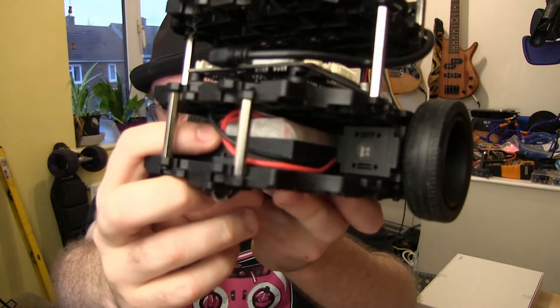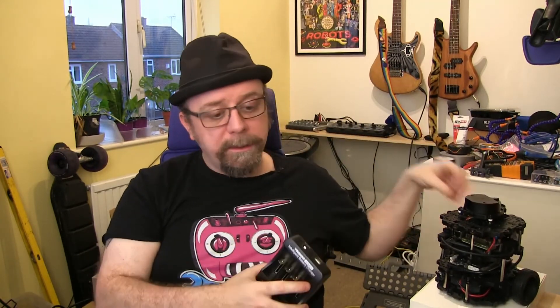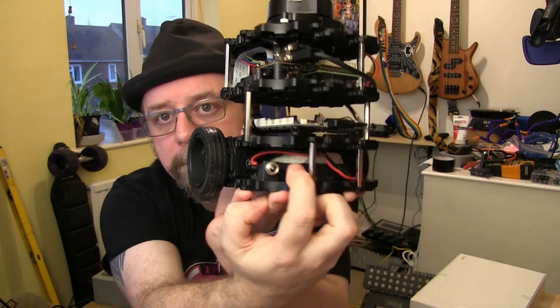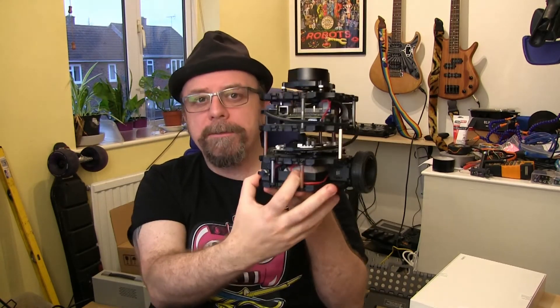The three cells in the new battery were scavenged from old laptop batteries. With my charger I'm able to charge and then discharge them to measure their actual capacity, which in this case is about 3 amp-hours each. The battery that came with the TurtleBot is 1.5 amp-hours, so through adding this new battery I've got more capacity, and the handy feature of just being able to plug in through the charge port and charge it while it's powered. It's just incredibly handy — a quality-of-life improvement, and it works a treat.